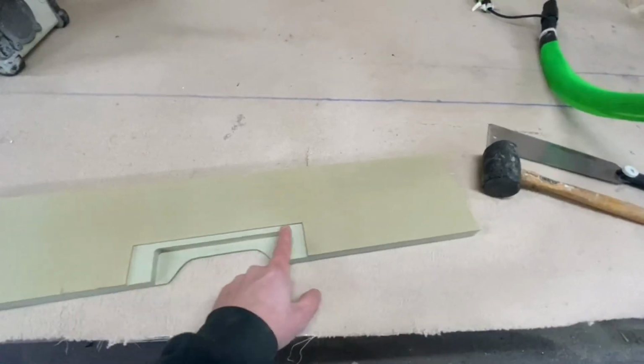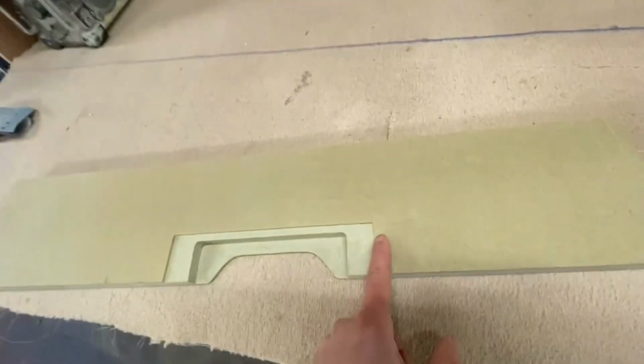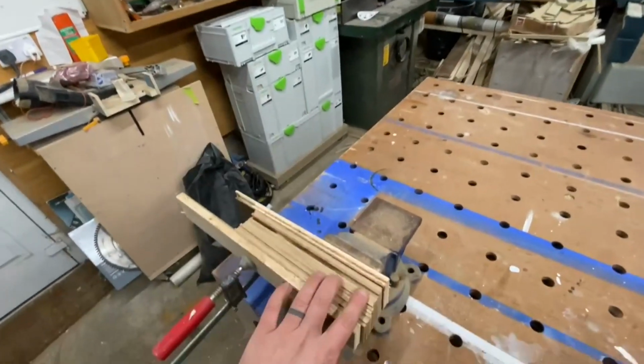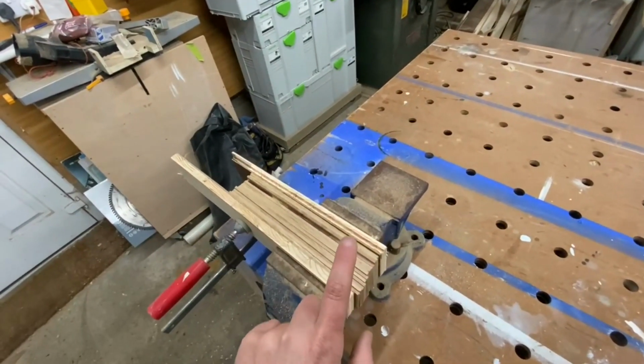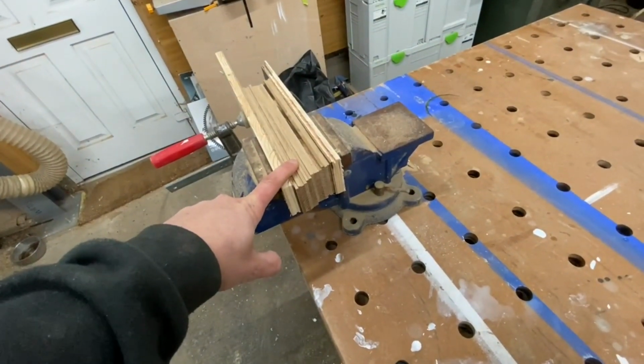And obviously I've done this bit on the back square. That's just because it's just easier to put a square piece of oak back in the back. That's just how I've done them. And they look quite nice. Make a feature. Just take the back off of this with a bit of sandpaper. And then you just sand these, which I did on Monday. Just sand these on the corners as well. It just has like a nice little softened effect. And these are solid oak that I run out on Monday. They're about 4mm, I think.